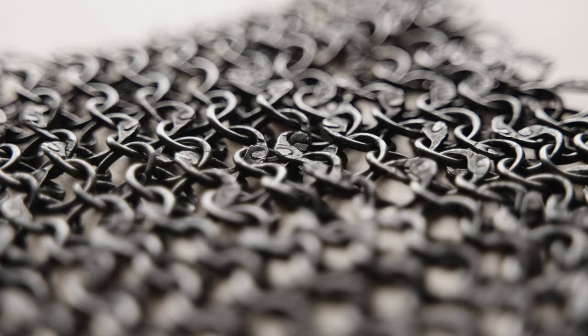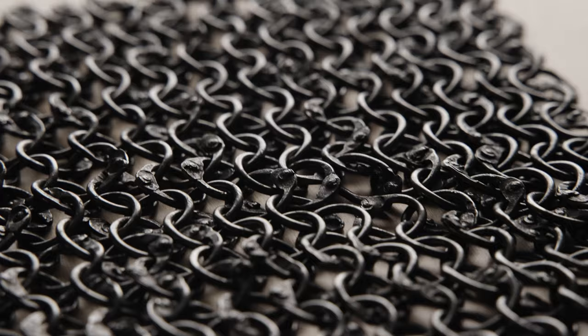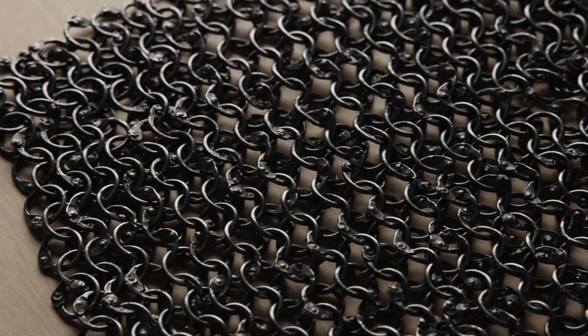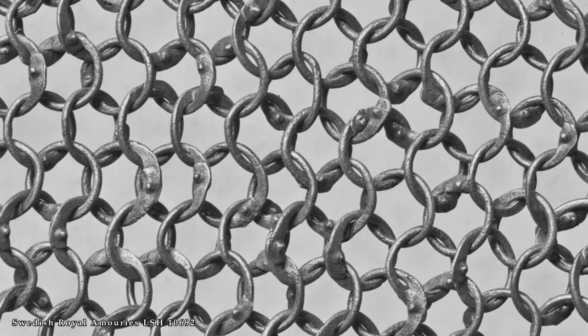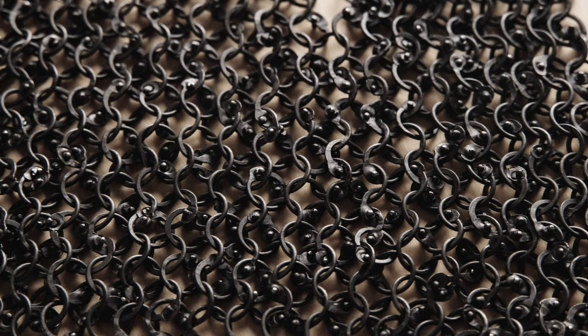From Sweden we have Jani Tila. His rings are flush on one side, half-domed on the other. The rivets are a cylindrical piece of wire pressed together with a lot of force — sometimes bent slightly to the side like clamps. Jani and I didn't quite know what to compare with. In the end I chose a photo from the Swedish royal armories, yet if at all it's a lucky shot. Zero points here.